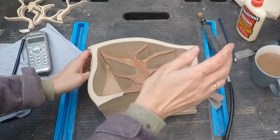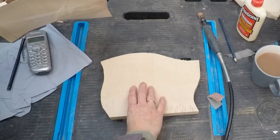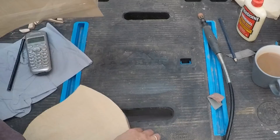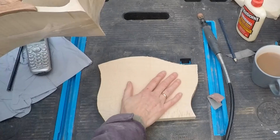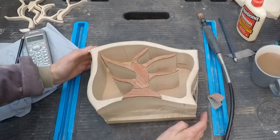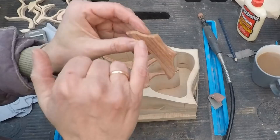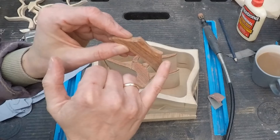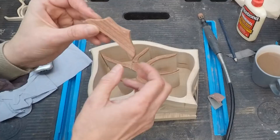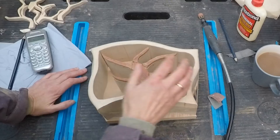That's the outer box sanded. I've managed to get a piece that's actually an inch thick for the back. Both sides need to be sanded flat because it's still very rough, dirty-looking wood. Once it's sanded I'll glue the main body to the back. The tree's done but not glued in place yet. I rounded off these edges and these ones get the intarsia look - they go down three quarters to halfway through the wood, then just a slight rounding off, which should look quite nice once it's glued in place and sand sealed.